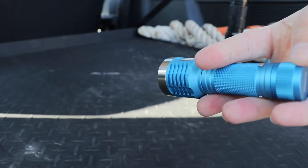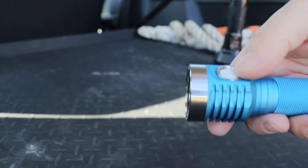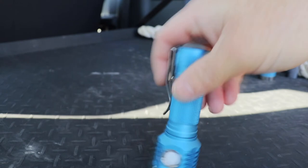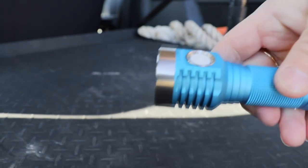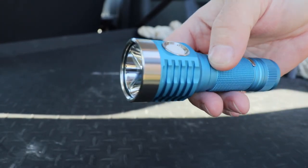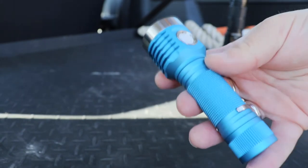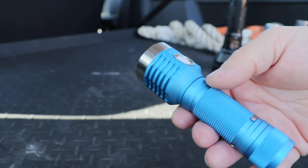I've done some tail cap amp ratings. On high - the top of the ramping - it's sucking 8.5 amps, which is the same as what the W2 does on turbo. And when this is on turbo we're just under 11 amps, so it's definitely quite a bit more being pulled on turbo mode. It's good and bad - obviously it gives you that peak performance if you need it, but with an 18650 you do notice the run times and the voltage on your battery drops very, very quickly. I do wonder if this would perhaps be a better setup having a 21700 - it wouldn't be quite as nice in the hand, but a 21700 doesn't make the tube that much bigger and you'd be able to run a battery that's quite a bit more capable.